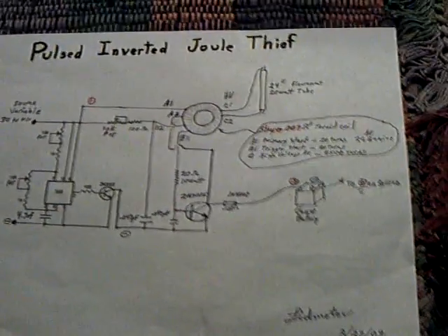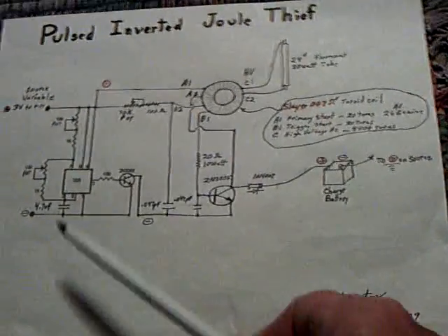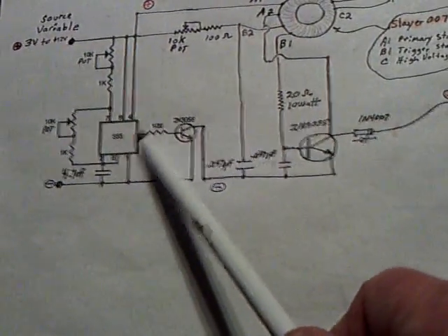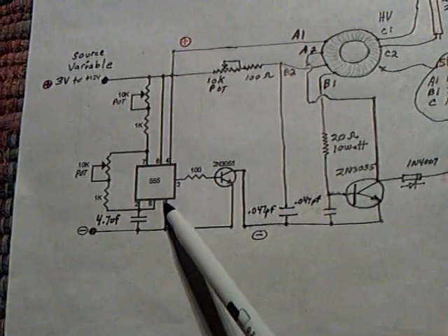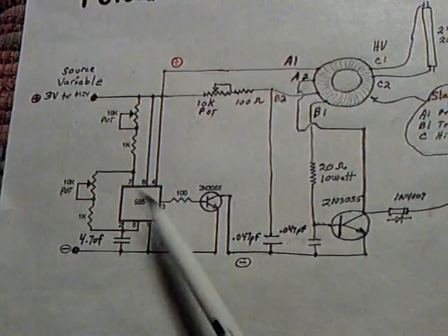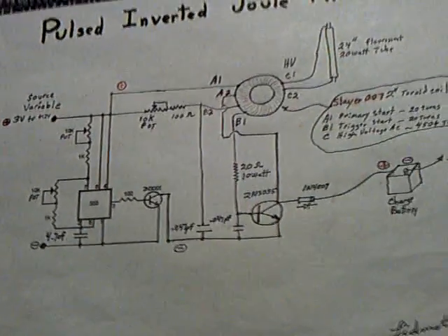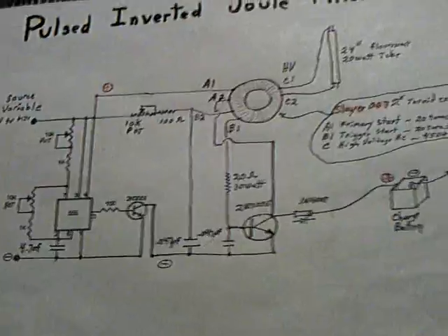I'm having great fun with this circuit. I tried the low-power 555 timer chip in it and played around with that. It works great with the LED circuits — goes way down to about 2 or 3 milliamps. But the minute I put it on the big boy here, it blew it right out. Paul has mentioned the same thing: they don't tolerate any large power at all.